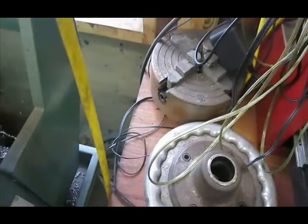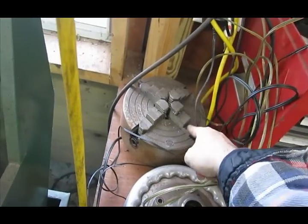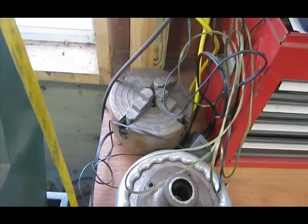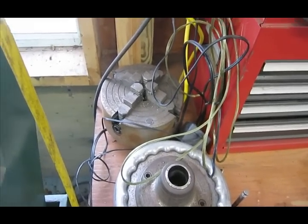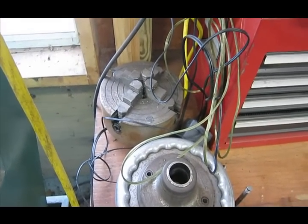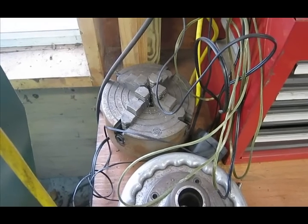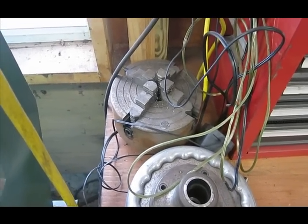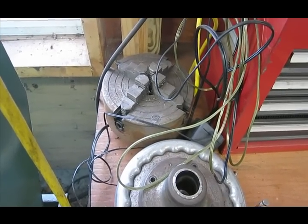The other common style chuck you'll see for lathes is called a four-jaw chuck. There are four jaws and they all move independently, which gives you the opportunity to hold irregular, non-round pieces of stock — like square pieces or rectangular pieces — or you can set it up to hold a part off-center. You could hold a round piece but have the center line of the part be offset. Think about machining a crankshaft: the main journals are on the center line of the crankshaft, but the connecting rod journals are offset.